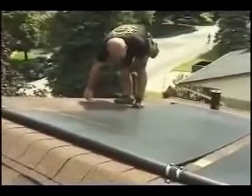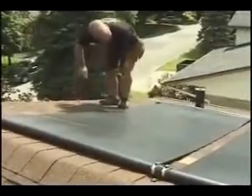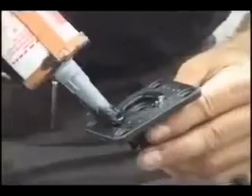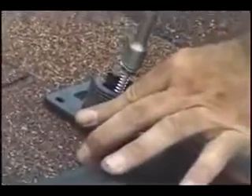It is very important to remember: only the top header of the array is anchored to the roof with a steel U support. Use a chalk line to mark the position of each mounting strap. Place a sufficient amount of caulking below each super clip, then insert a lag screw and screw to the roof. Repeat the same procedure for each super clip.